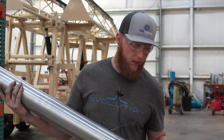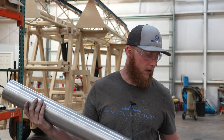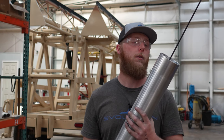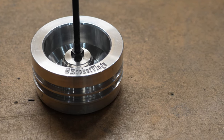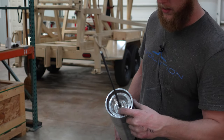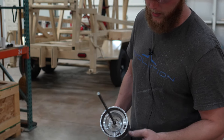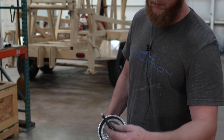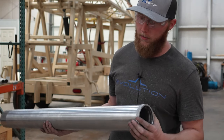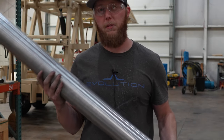The motor's going to run at around 1,600 PSI. That sounds like a lot, but the burst pressure on this case is up to about 3,000 PSI, so it's really not a problem. This case has already been tested to almost 1,800 PSI with no problem. The bulkhead is where the motor retention takes place — we have a high-pressure stainless steel NPT fitting in the center. The all-thread is threaded into the NPT fitting and also potted in epoxy to help seal it, with a jam nut for extra measure. We've also got a standard thrust ring down here for hobby rockets. Zero to full thrust in less than 10 milliseconds — she's going to be spicy and she's going to move.